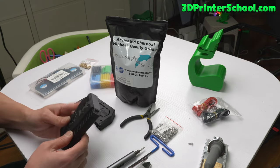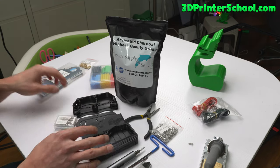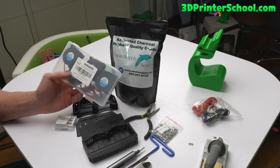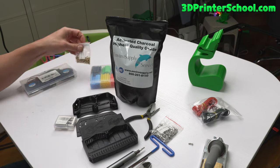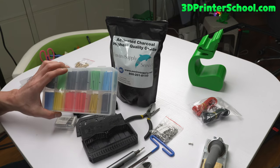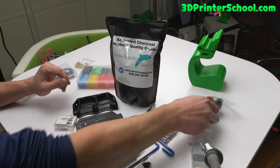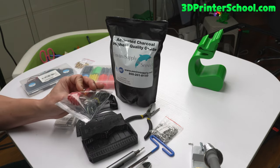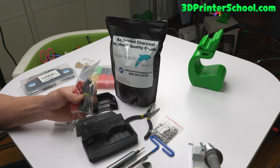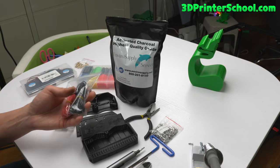ABS is a great material. You're going to need these four printed parts, and you can grab these cheap 5015 fans — 24 volt Winsen fans on Amazon, I'll have links. You'll also need M3 threaded inserts, heat shrink, a soldering iron, and some wires. I've got AWG20 silicone wires here, but AWG24 should work too. These silicone wires are going to run under the bed.